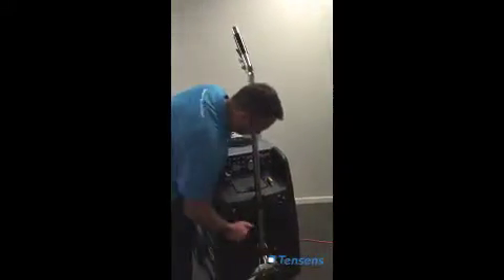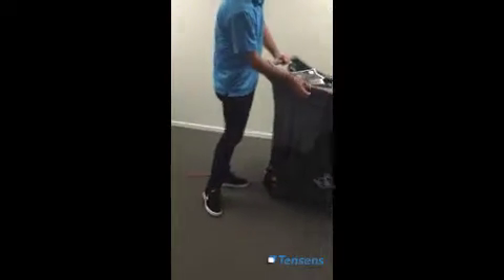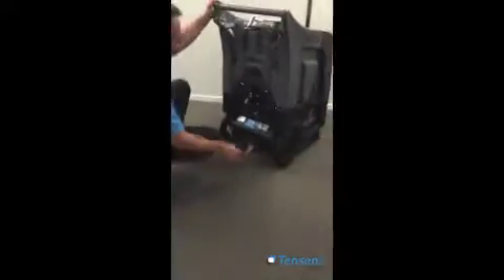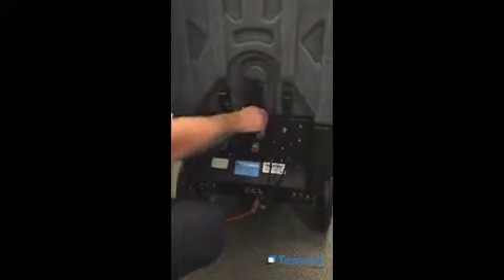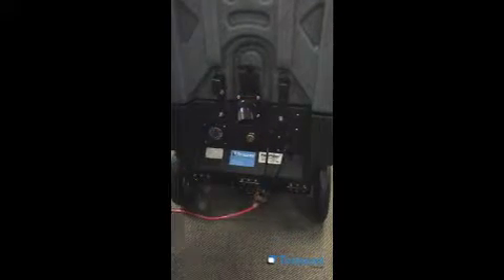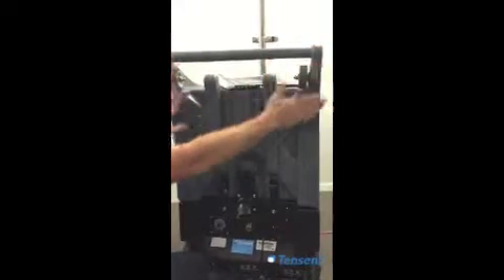There's a wand holder on the front. On the side, you have some brass inserts — take these out and you can put little clamps on. On the back of the machine, you have your dump valve here. You can dump that into a bucket, the grass, or the garden, but not into stormwater. Back to sewer is a much safer option. You also have cord holders and wheels on the back of the machine so you can push your machine up to a van.